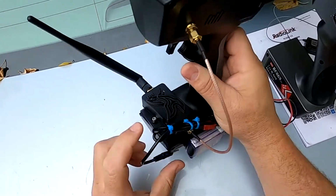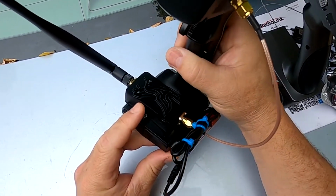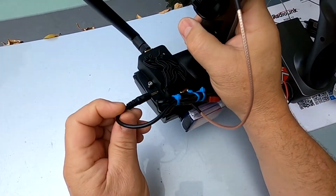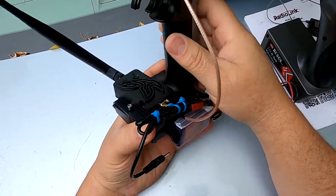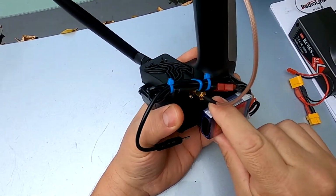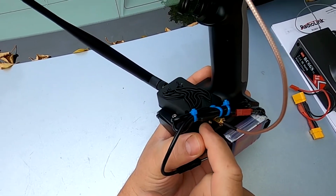So basically, this is a Wi-Fi booster for your Wi-Fi in your house, and it comes with this plug. It goes in there, but it's actually to go into an electrical outlet. So what you do is you cut this. There's a red and a white wire. The red wire goes to your little battery that powers this. This is the power for this now, instead of plugging it in.